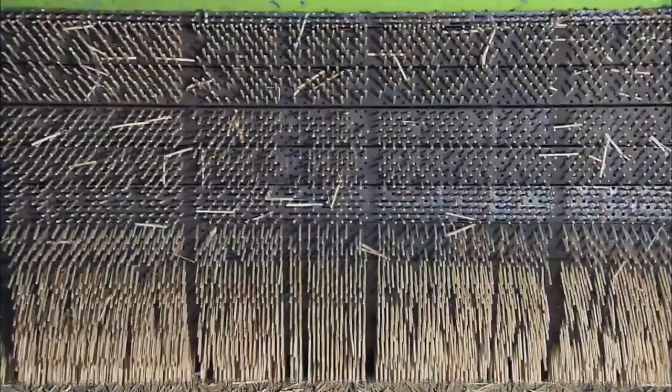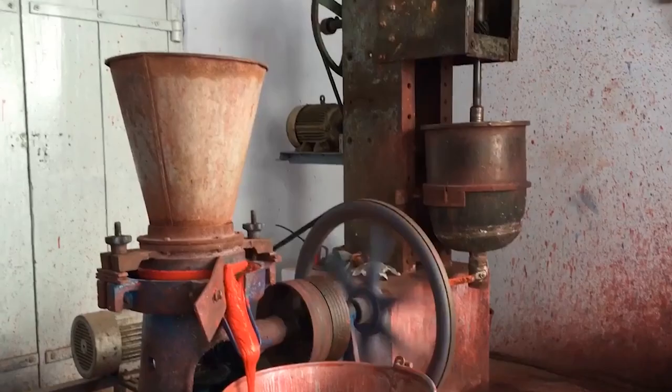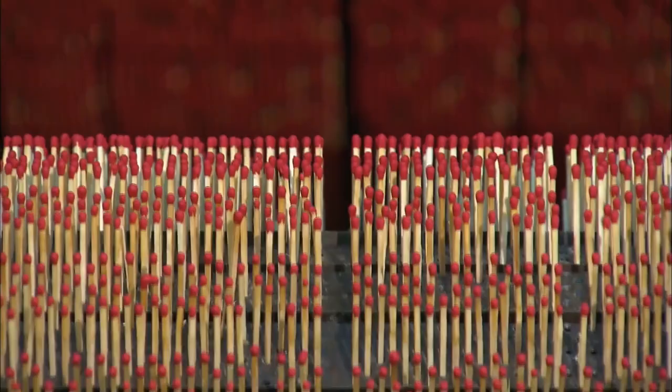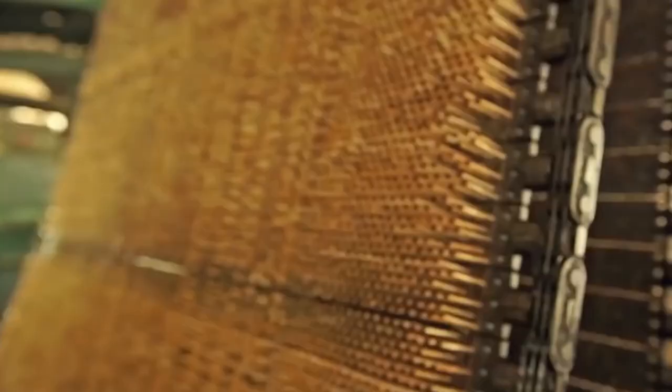During the dipping stage, the conveyor belt brings the splints over a vat of continuously mixing combustion mixture, kept mixing to prevent it from solidifying. Once the splints are in place, a press dips the entire belt into the mixture, depositing a perfect little drop of thick combustion mixture on each splint head. After this, they are allowed to drip the excess mixture back down for about five seconds, and once the amount is deemed correct, they move ahead while another set of splints takes their place. The completed splints then travel on the same conveyor belt in a dry room for about an hour to completely dry and solidify the mixture, as even the slightest amount of water may make the match unusable or cause an unwanted chemical reaction.